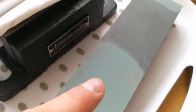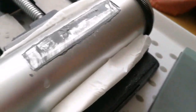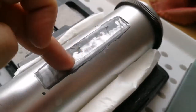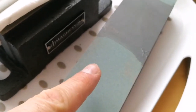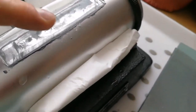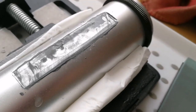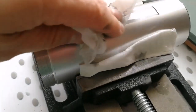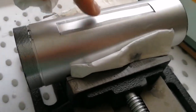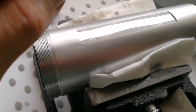And for that, I have to make sure this surface is wet first of all. I put a few drops here with my finger, and I'll try to hold this with one hand and make sure that my water stone is always horizontal to this surface, so I uniformly remove the material from this. And it's not much, I can just do it gradually. Okay, I think I now have a good grip surface. I don't want to continue to the middle, and that is a risk I'm not going to take for non-uniformity.